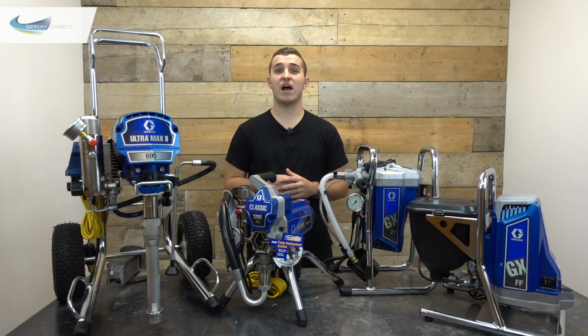But every now and then we get asked, on average once a month, to do a mist coat on new build houses where I'd like to use my wide angle 1221, so that's 120 degrees wide with a 21 thou hole through the centre.